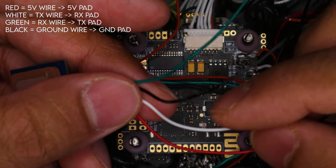Remember: every time you arm your quad, your home location updates. So if you pick it up, move it ten feet to your right, and arm it there — that's your new home direction and distance. Right now I can see GPS Speed highlighted, the home direction arrow, and home distance showing 432 meters from home. My craft name shows Joe Pilot — it's actually supposed to be SupaFPV. This is the satellite count, and these are the longitude and latitude. Set it up however you want and click Save.